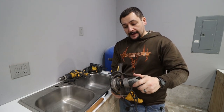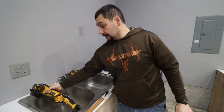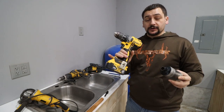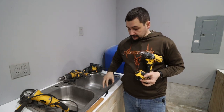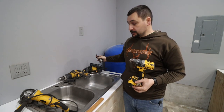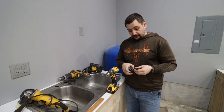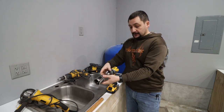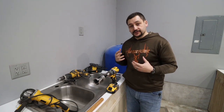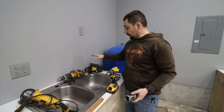In my application, I wasn't going to use an angle grinder because I only had my own two hands. If you already have a cordless drill, this would also work. When you order this bit on Amazon, there are adapters in the commonly-bought-with section. The adapter I purchased works with a concrete drill, but they also sell one for a standard drill. Put it in low speed — I'd recommend a larger battery — spray water on and away you go. Many new drills have e-clutches where you can set the clutch mode to save your wrist. A drill with an extra handle would be more applicable. This could save you money if you don't have a concrete drill.